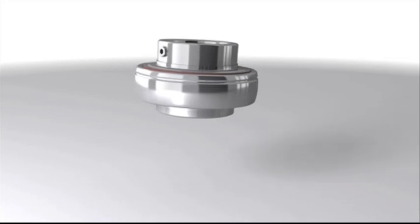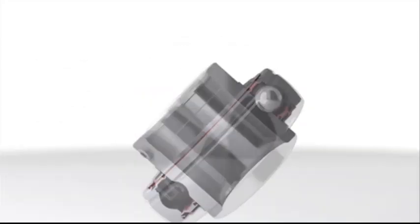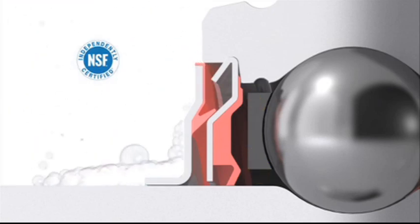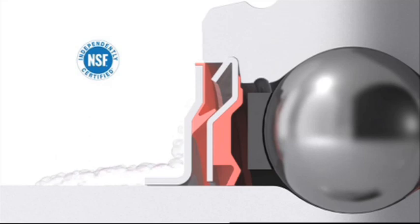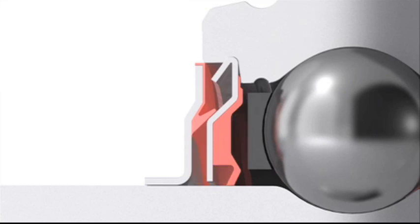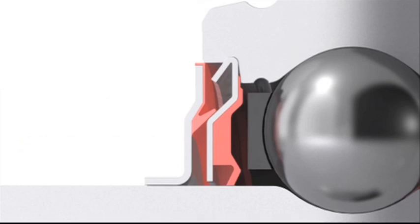This result is due to the seal, which prevents the washing liquid and any process material from entering the bearing and which prevents the lubricant from leaking out. Its design includes a special flinger, an interference fit to prevent detergent creep, additional grease fill and a low friction multi lip seal. These features make it possible to have a maintenance-free unit which requires no re-lubrication.